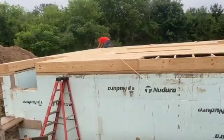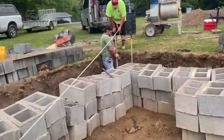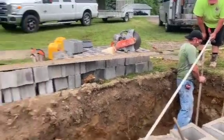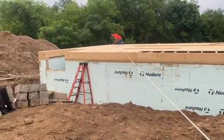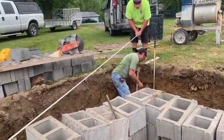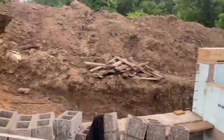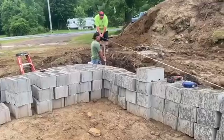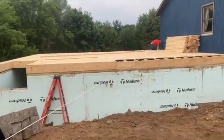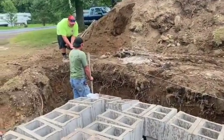We're checking out the diagonal right now, guys, to square up this garage with the house. Mike's got two levels, holding them plumb. That's what we're trying to do here — get our square. It should be 67.1 for our diagonal. We've got to move over quite a bit. Now we're measuring the other diagonal — these diagonals should be the same. This entire building is 30 by 60, counting the garage within the other foundation, and we want these diagonals the same. Very important to get this nice and square.